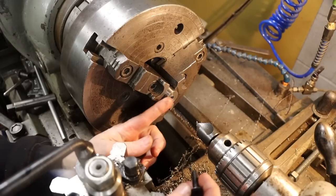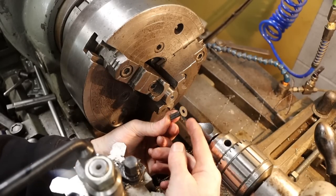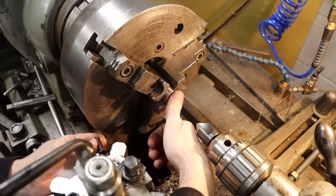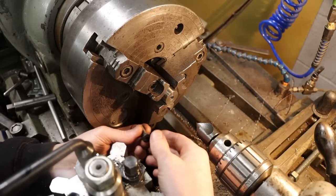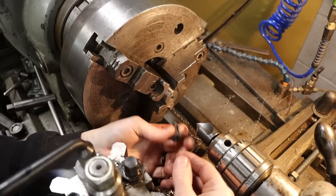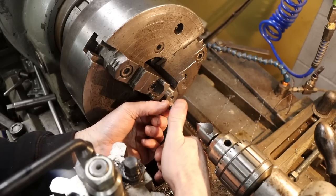So now it's time for me to countersink the end of this tap with this 82 degree countersink. And all I'm after is the head of this bolt to set just slightly below the surface. All I'm going to do is come in, take a cut to where it looks about right, do a test fit, pull it out, take a little deeper cut. That's all I'm after, just a recessed head.